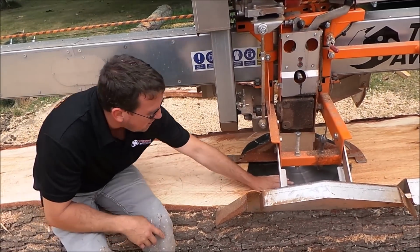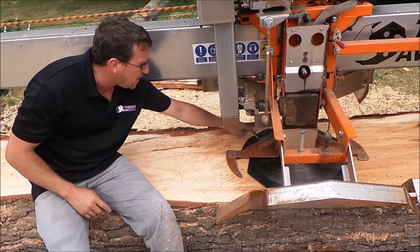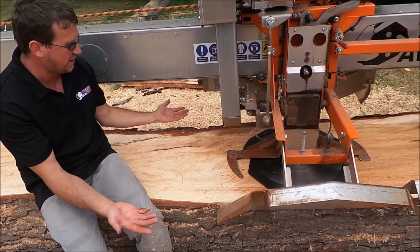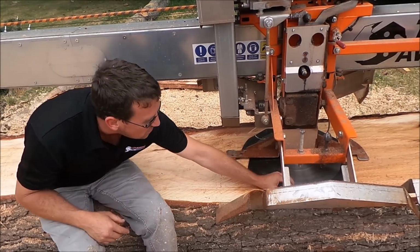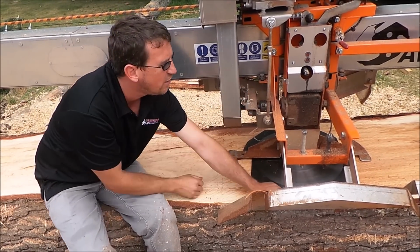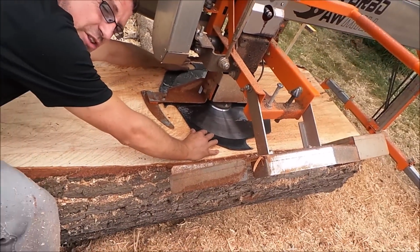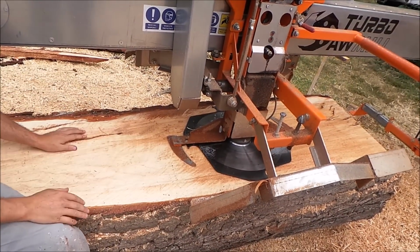So you can also check the lead in. The lead in is when this side of the blade over here, the cutting side, is slightly lower than the back side. And I can see that it's adjusted well anyway. One, that we don't have big lines between transitions. And two, you've got about a 2 millimeter gap as far forward that way, over here to the slab, and it's touching on the actual cutting side. So we know that that lead in is adjusted pretty well.